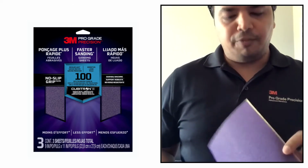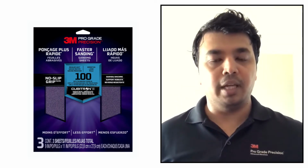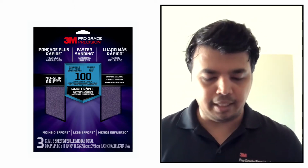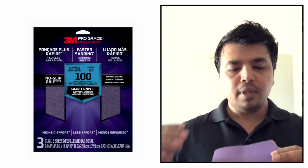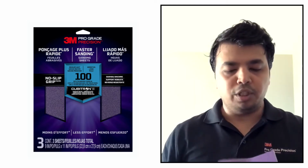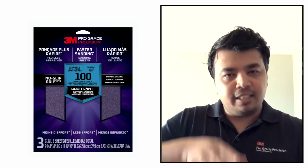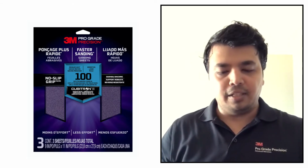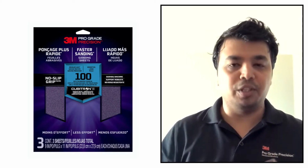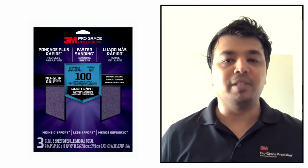Now, as I mentioned, the development in the mineral. So 3M actually engineered shapes of this mineral and called it the Cubitron 2 technology. The mineral has these peaks in a specific shape, which actually slices the substrate. So when you're sanding, it slices the substrate, and it is a very strong mineral, so it doesn't break. But when it breaks, it always breaks at an angle, so the sharpness of the mineral is long lasting, and because of that, it provides that performance acceleration.